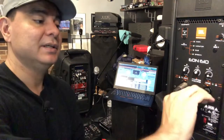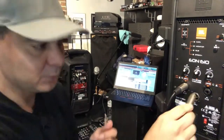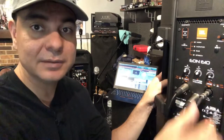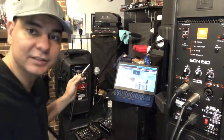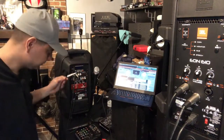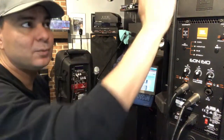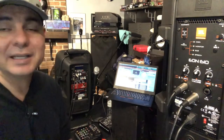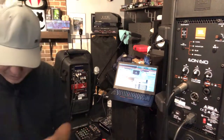This cable I have here happens to be XLR to quarter jack, which will also work — these speakers accept the quarter jack as well. You take the link or through output and connect it to your other speaker. Boom — two speakers connected. Your laptop goes to one speaker, and this cable takes the signal to the other speaker. Either cable will work, no problem.